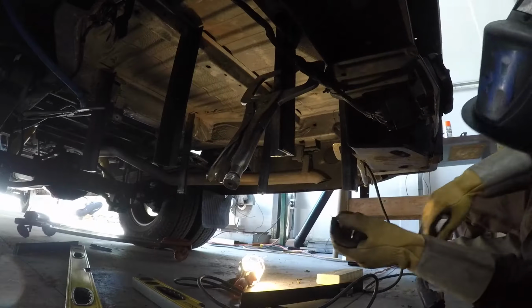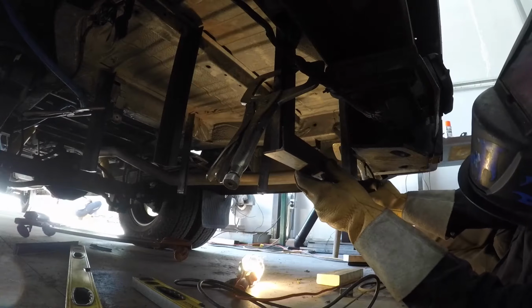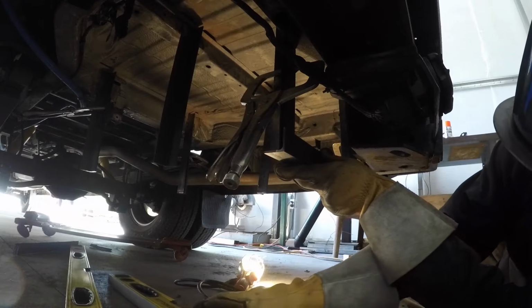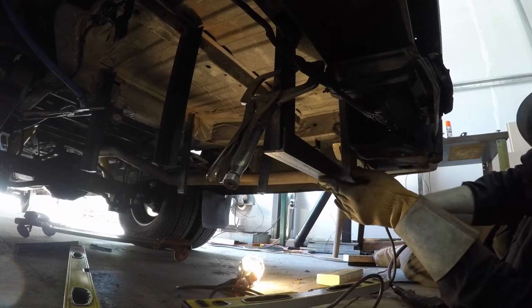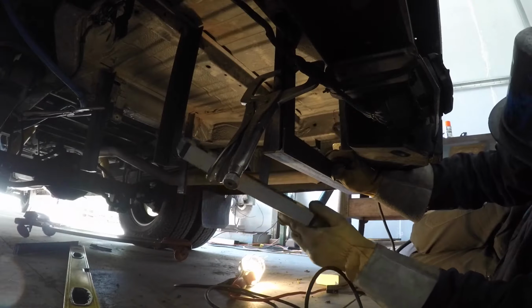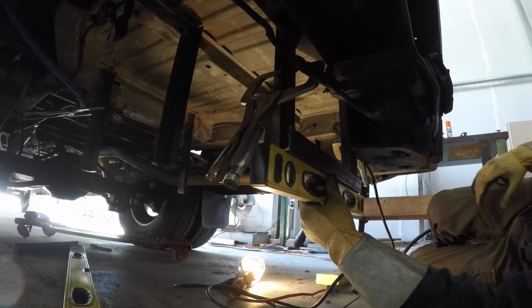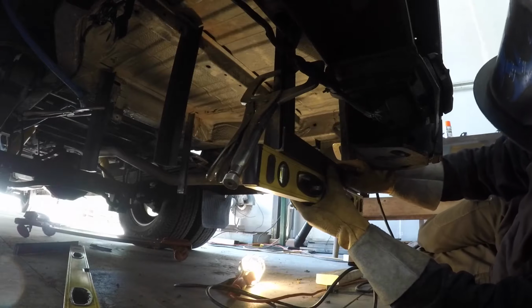Now I have the vertical supports welded to the van and cut down to size. I have the vertical supports of the bottom portion of the rack clamped to the supports welded to the van. And I'm going to start making the platform that will actually support the batteries themselves. So in order to do that, I'm just going to have all my pieces of angle cut to size. I will level them off and weld directly to the removable vertical supports, the ones that are going to be a part of the bottom portion of the rack.